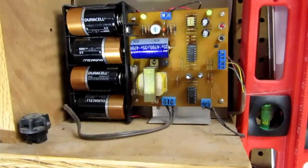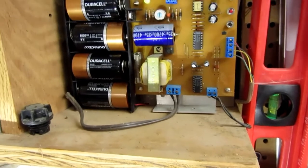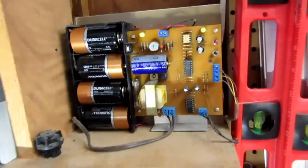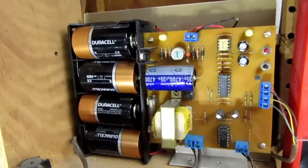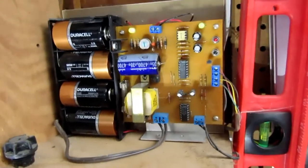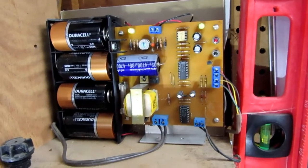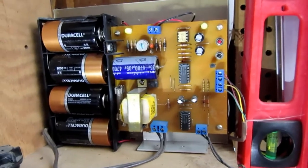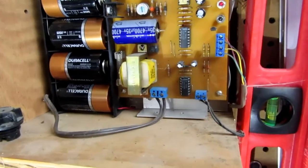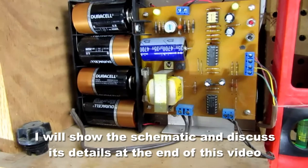That has saved my bacon so many times. I'll come home from a trip and won't even realize it rained while I was gone, and it'll tell me there was a high water issue even if it didn't crest the sump pit. I'll know that it reached that level or that there was a power outage, and I should check various things affected by power outages. This is the thing that woke me up the night the huge thunderstorms came through. Otherwise I would have been blissfully unaware that I had a big problem and had to take quick action to keep from a big disaster. If I hadn't had this, I probably wouldn't have heard the other systems. It's a pretty cool thing — I don't know if there's any commercial equivalent, but it's pretty easy to whip up on your own.